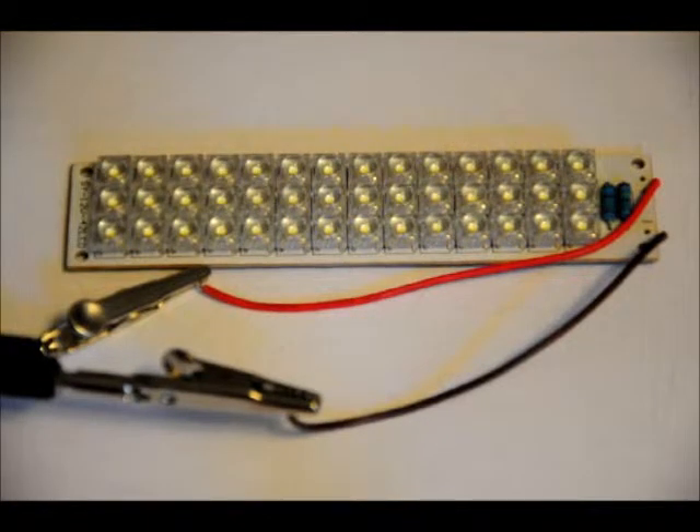There are two wires, red and black. Red is for your positive 8 to 12 volts. It works at minimum 8 volts, which gives you minor luminescence. 12 volts gives you a whole lot of light. It requires about 200 milliamps at 12 volts and about 2.4 watts of power. All the specs will be available on the listings at EngineeringShot.com and ElectronicLessons.com.